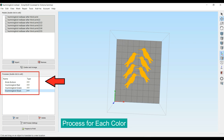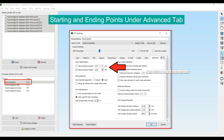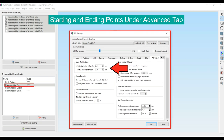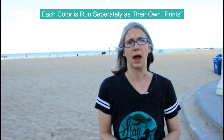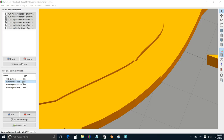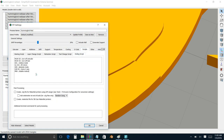With my multiple processes in Simplify 3D, I set up a process for every color. If we take one of my birds as an example, the first color would be for two millimeters, then I would switch to the next color and just do maybe 0.3 millimeters for that next phase, and so on. When I do run these independently as separate prints, I do have custom starting and ending scripts for them — very similar to where I'm embedding parts with mirrors or nuts with tap handles — with deviations in my ending script for processes that are going to have another color afterwards.